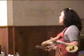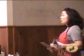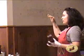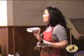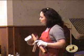It will, they call it mellowing or patinating. Linseed oil yellows the most. As you go up the scale of refinement, it yellows less and less. The other thing though with teak oil is there is an amber teak oil, so you can buy teak oil that has a color imparted in it. And you would use a colored oil if you had maybe a faded wood, or wood that you want to kind of lighten up a bit.